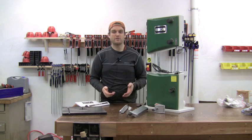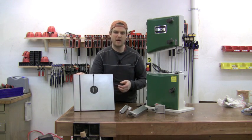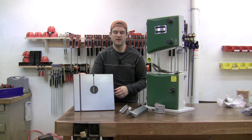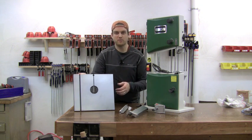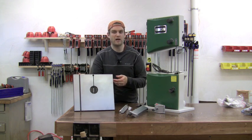The first step after unboxing is to remove the plastic coating and the protective grease from the table top. You can use any kind of household spot and grease remover to do that. It's then a good idea to put on some protective coating so that the cast iron doesn't rust — a coat of paste wax is a good idea.